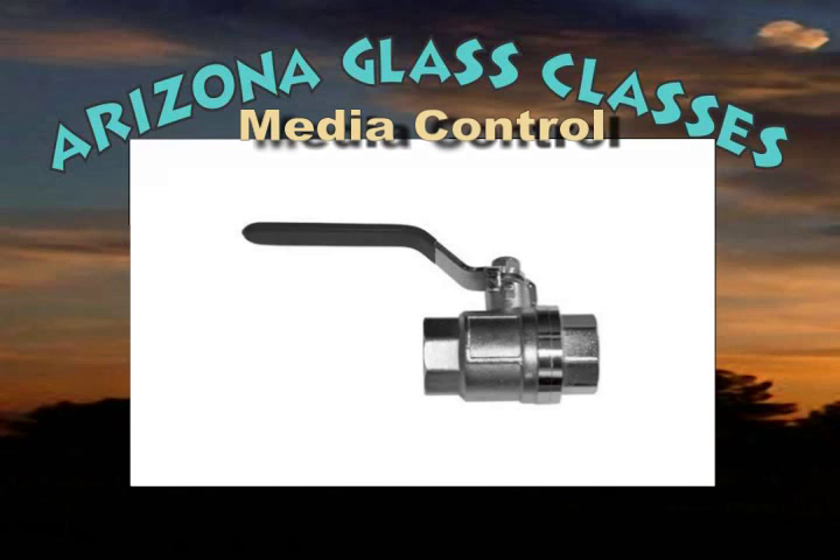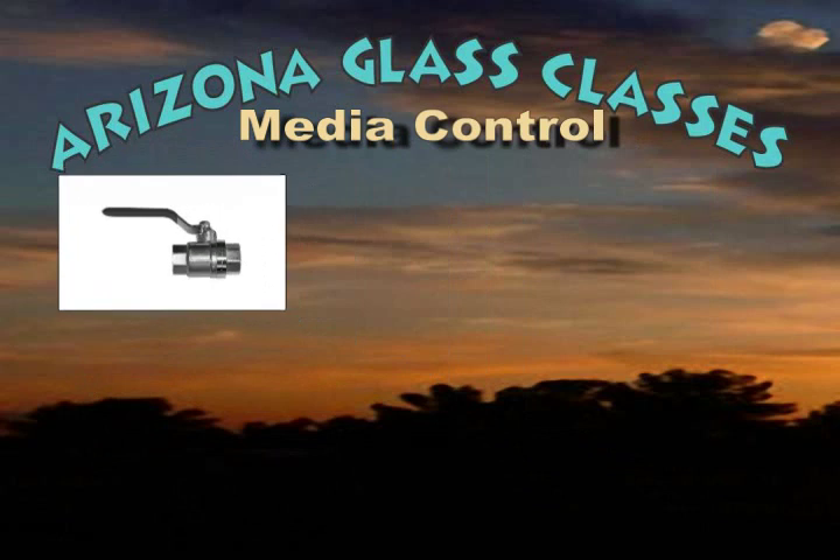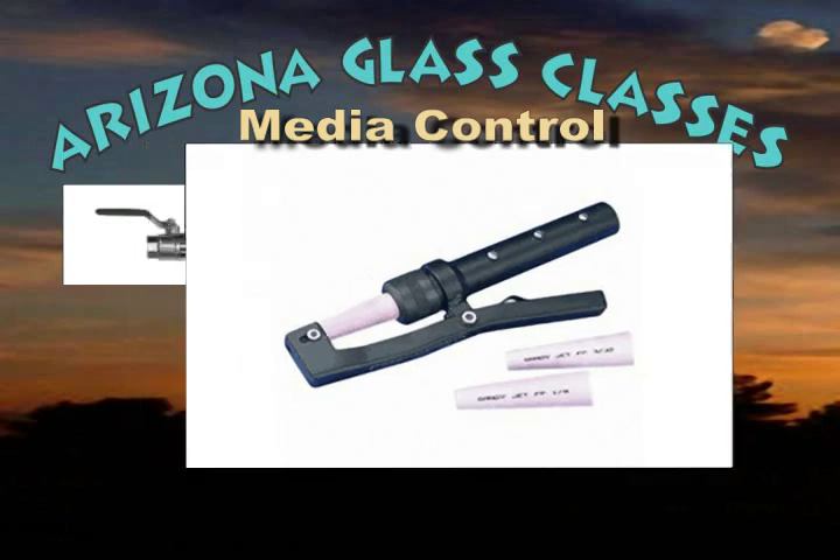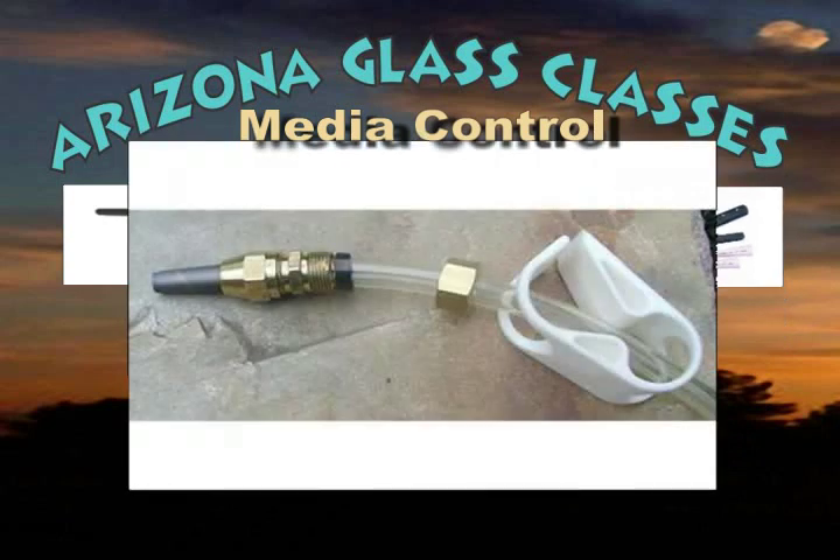You will require some type of control over your air and media flow. The simplest control is a ball shutoff valve that can be mounted anywhere in the airline, though it is clumsy since you'll have to take at least one hand from the nozzle and your object being blasted to open or close the valve. A dead man valve is a common valve used with many sandblasting setups — squeezing the lever on the side opens and closes the valve controlling the air and media flow. A simple pinch valve mounted on a flexible plastic hose connected to the nozzle will pinch the air and media closed when activated.